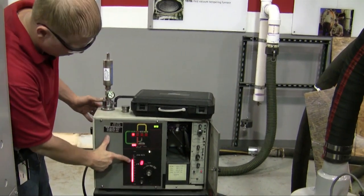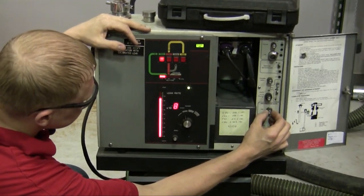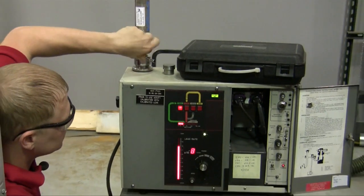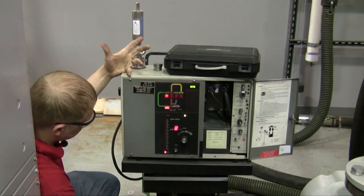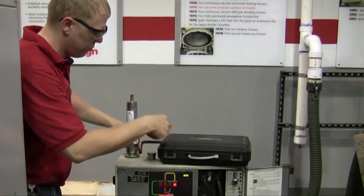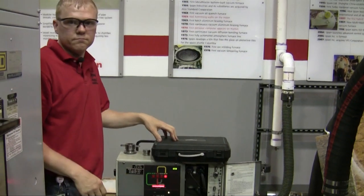As you can see, we're pretty close. Adjust it here with your calibrated adjust leak rate. It's right on — close the valve and it should go down to zero. About right. Go ahead and hit vent to clear it out, then open the valve back up before you put it away. That's how you calibrate it — now you're ready to go.